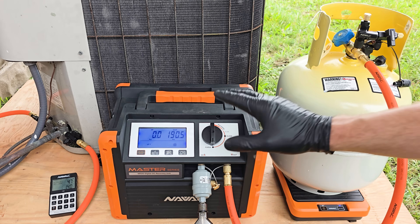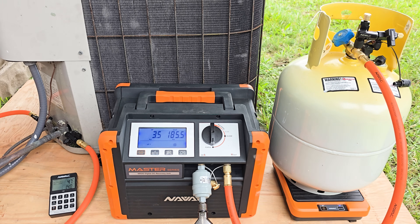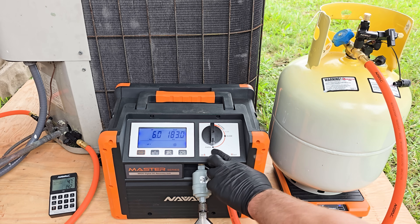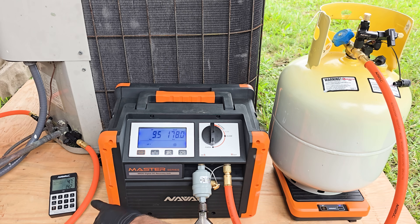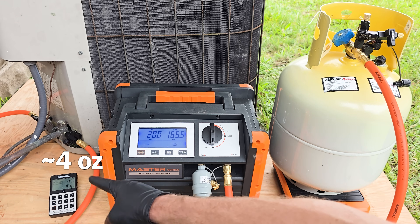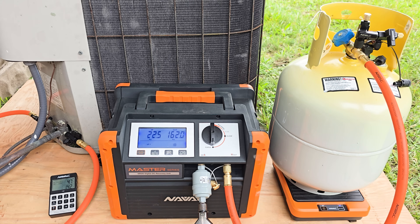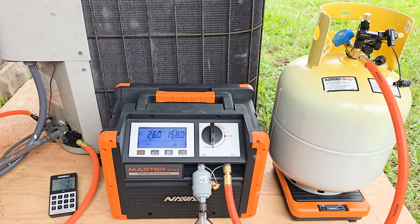We also don't want to recover below 0 PSI on this unit because we don't know if the unit has a refrigerant leak. It's been 10 minutes and we're going to go ahead and turn this to the purge and turn it on again. Over here on the scale, we've recovered an additional about 10 ounces from inside this recovery machine with the purge function — that's a significant amount. When we first recovered, we turned it off, waited 10 minutes, saw pressure rose to about 11 PSI, turned it on again, and recovered another 4 ounces. Now we're going to turn this system back on to recover this small bit of refrigerant that's flashing from liquid to vapor.